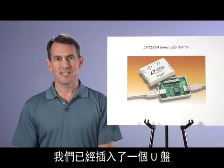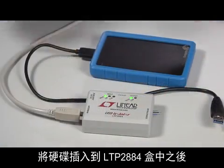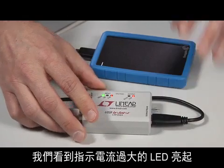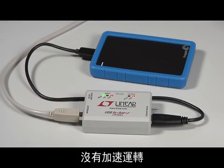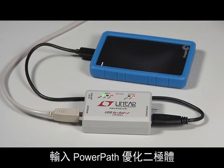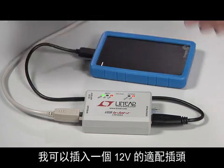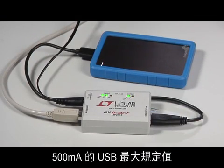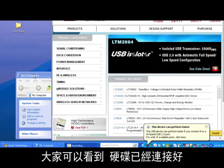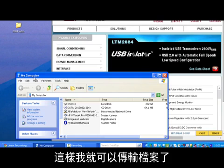Since we've already powered a memory stick, let's move to a more power-hungry peripheral — a portable hard drive. When I plug the hard drive into the LTP-2884 box, we see an over-current LED light up, and the VBUS2-powered hard drive doesn't spin up. However, the LTP-2884 includes an input power path ideal diode. I can plug in a 12-volt wall adapter, which will feed the LTM-2884's VCC, increasing available isolated output power to the full USB spec of 500 milliamps, and successfully powering up the hard drive. You can see the hard drive has connected and is displayed on the computer after enumeration, and I'm able to transfer files.